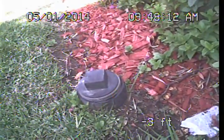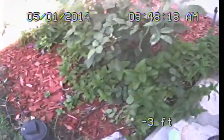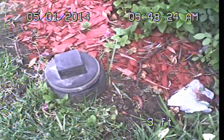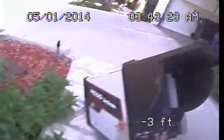Alright, so here's our 3-inch clean out here, and this is again just to the right of the driveway and the little planter area here. And this is a two-way access. In other words, it's going to allow us to push the camera in both directions. So first I'm going to drop in and push back towards the structure, mostly because this clean out's further away from the building than would be standard, so this is a reasonable application here.